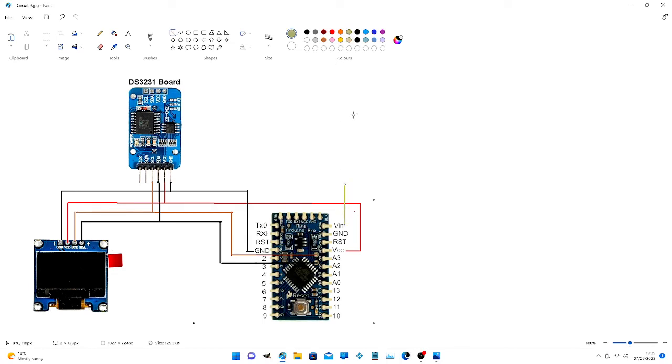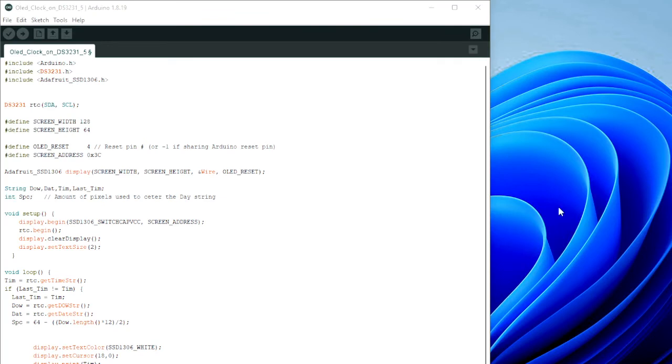The voltage I put in as 5 volts. It'll go up to 12 volts, the raw voltage in, but I'm using 5 volts, which is handy for me. But it will go up to 12 volts and still only give 3 volts out on the output pin. Like that. Right, you'll also need a ground. I just showed you the positive. This is the breadboard layout. So the breadboard won't give 12 volts out, it'll only go 3 or 5. So I'm using the 5.